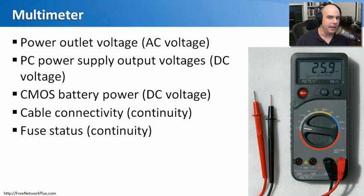If you're working in networking, you must have a multimeter — the Swiss Army knife of networking. It measures AC and DC voltages, whether from a wall outlet or a router's power supply. It can check battery voltages, perform continuity tests to see which pin connects on the other side of a cable, and check fuse status without pulling the fuse out. A great way to take advantage of the continuity features to reverse-engineer how a cable is wired.